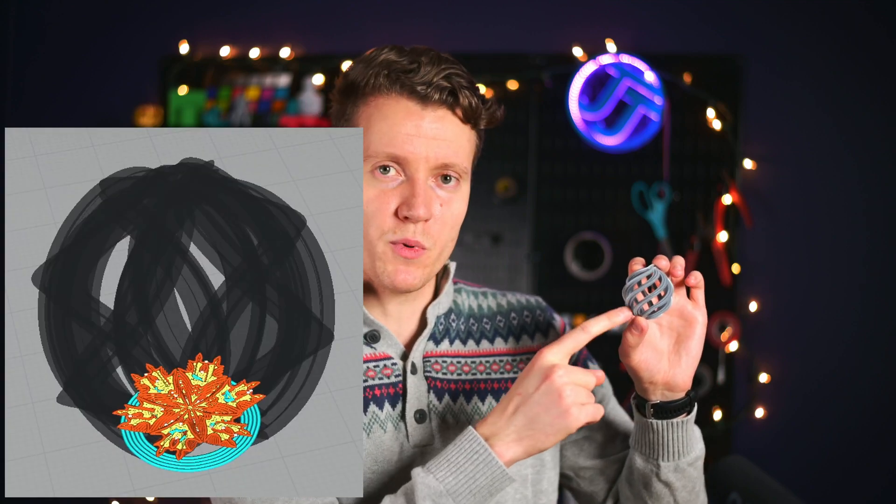A way to think of lightning infill — it's kind of like tree supports but for the inside of your print. This is a great example of a purely decorative print. It doesn't need to support weight, it doesn't need to be very strong at all. A single wall on the outside works fine. But all of these parts of the print are hollow, and so to support the top parts it can be useful to have internal supports. That's true at both the top and the bottom — some supports in there really help. But instead of using a normal grid infill that fills the entire print, lightning structure places it only where it's really needed.